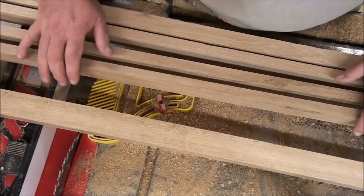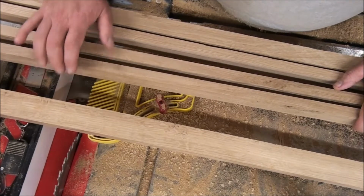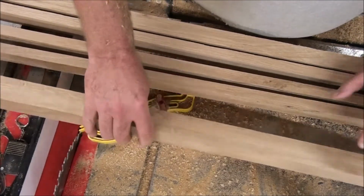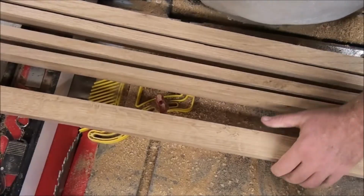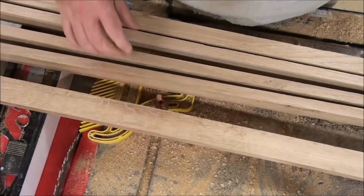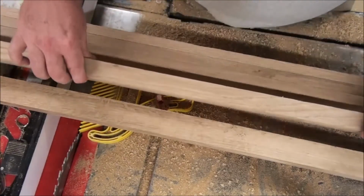And you can see this is a 3-horsepower saw, and you could hear it kind of slowing down a little bit going through there. It's a fairly sharp blade. It could be sharper. You need to keep moving. I paused a little bit here, so it burned. Miter saw, I paused a little bit when I was cutting it off, so it burned. So it burns, I wouldn't say easily, but it will burn. Maple burns easier. Cherry burns terribly easily. So anyway, that's some of my trim pieces. I'm not sure that'll be enough.